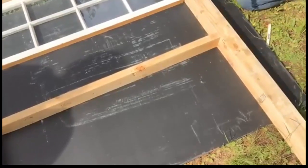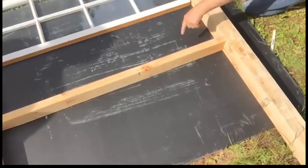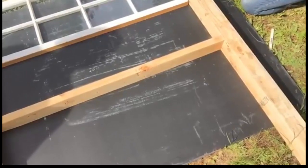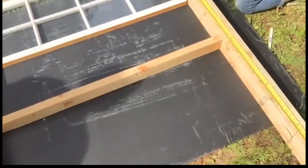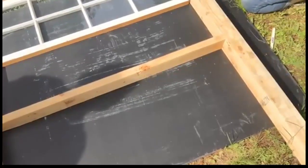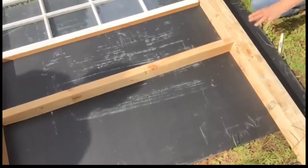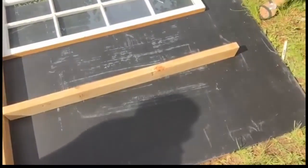Yeah, so with Terry's, to fill this kind of gap, we could do a scallop backsplash in here, or we could add a second shelf in here. So we're going to trim our posts up probably about 2 inches and cut those down. We're at 72 now, so we're going to cut these posts at 70 inches. If you guys want to hang out while we cut our posts down to 70 inches, that's fine by us. So we'll give these to Paul, the invisible man, and...